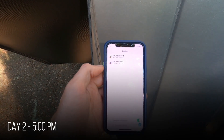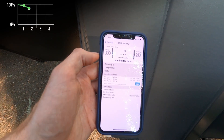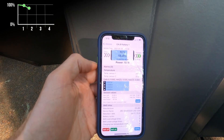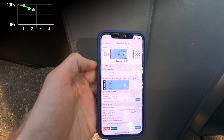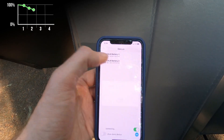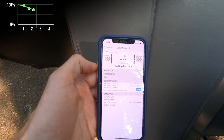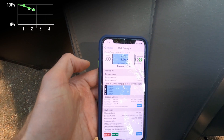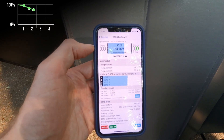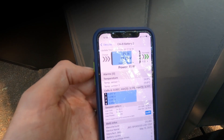We're at about 5:13 PM — let's see where we're at on battery. So after more than a full day of use, we are currently at 72%, so we dropped about 22% from last night when we first measured this. If we look at the second battery, the first battery was at 13.28 volts, and this one's at 13.26 volts — a little bit lower — at about 71%. That's tracking with where I've been with these batteries.